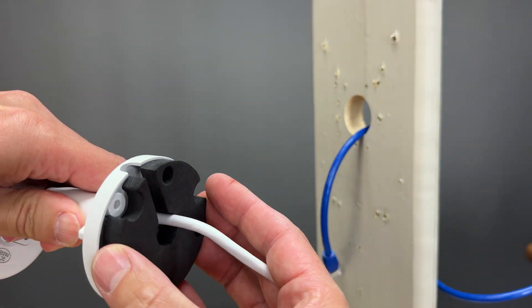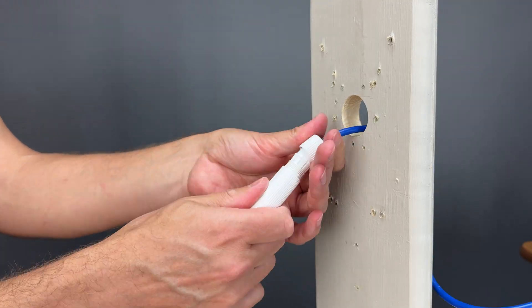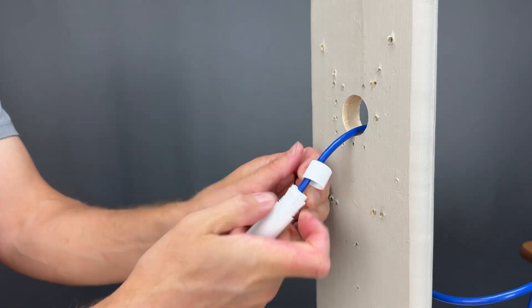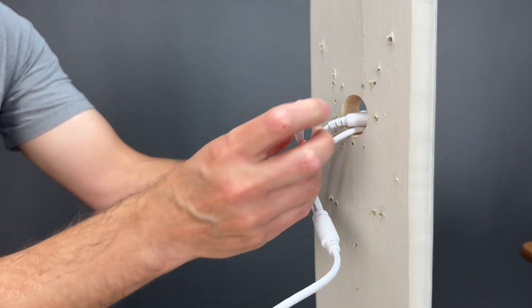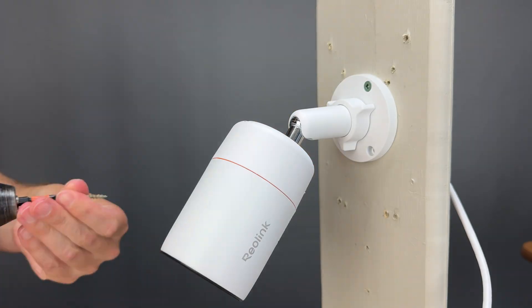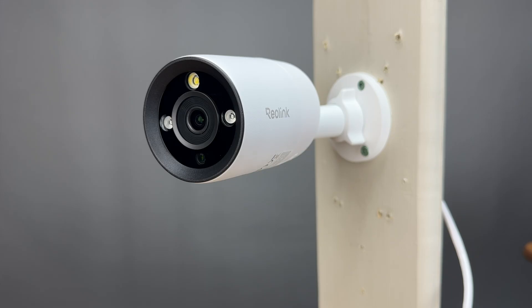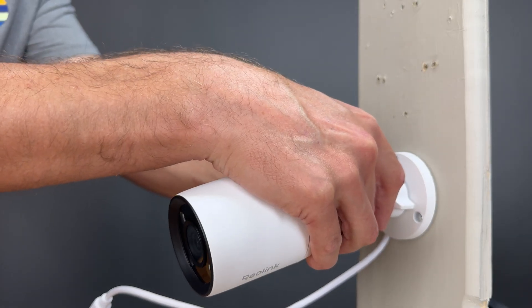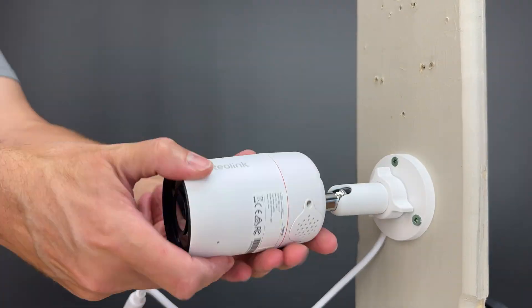Let's jump in to see what a typical install would look like. First, install the foam piece behind the mount, then feed the wires through the grommet, plug in the camera, and tighten everything up to complete the seal. In the first example we have a mounting surface with a hole to run the camera's wires — this could be an eave, a junction box, or a hole in the wall. Once everything is lined up, add the three screws, point the camera in the desired direction, and tighten the mount. Now if there is no hole for the wires, the cables can exit through a slot on the bottom, and then follow the same process: fasten the screws, point the camera in the right direction, and tighten the mount.